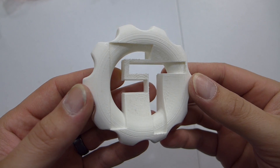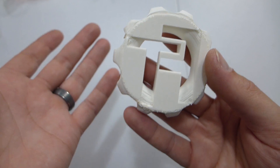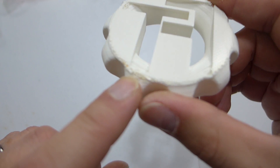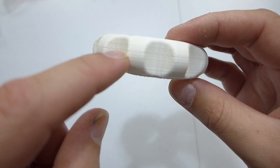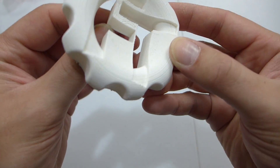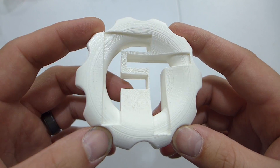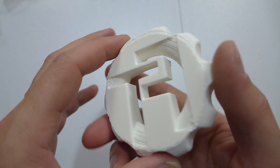Starting with the IC3D White PLA — looking from the top, it looks like a fantastic print. But when you flip it over, it's a totally different story. It did very poorly on the first few layers. This was printed on the GTEC A10. The first layer was good, but where the support was meeting it, it just had a bad day. There was under-extrusion up in here. And it peeled up on the center where the F and T come together. This just did not perform very well as a standard PLA.